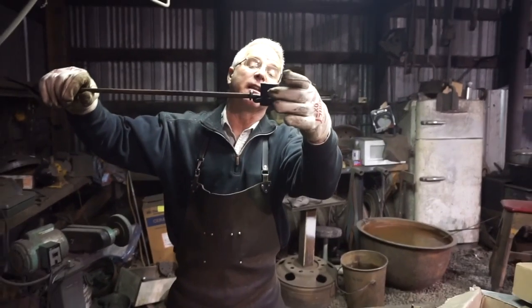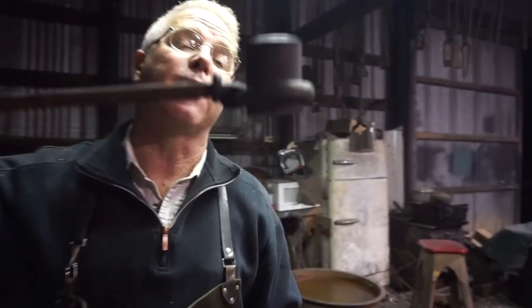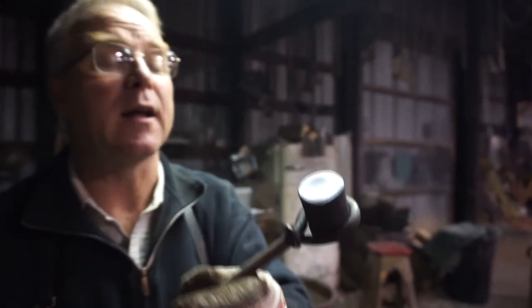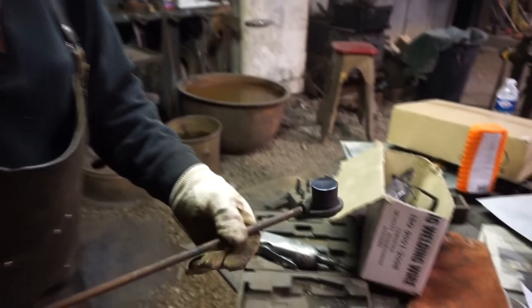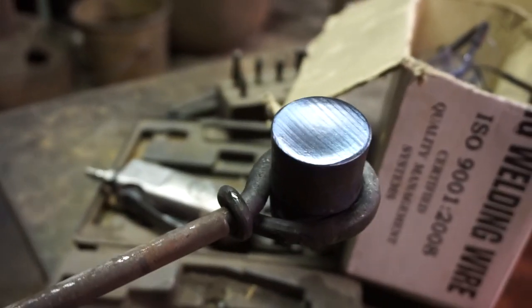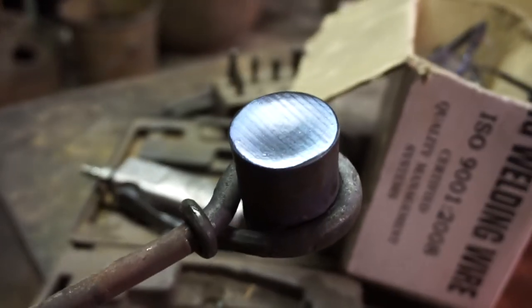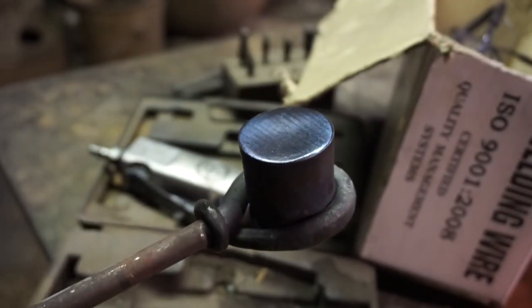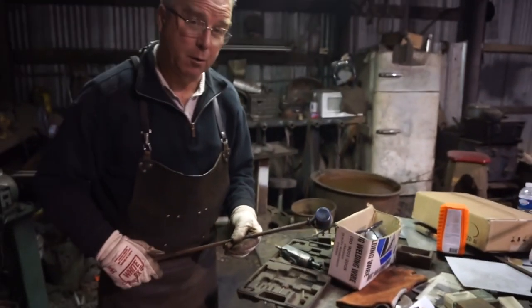You can see that it's getting a little bit upset. It's being flared on the end from the impact, so I'm going to grind that off. But let me point out the color. Can you see the color of that face? That's because setting it down in there gets it up around 600 degrees, which is full royal blue. And it just makes a very nice blue-black color that I'd like to try to get when I wire brush.